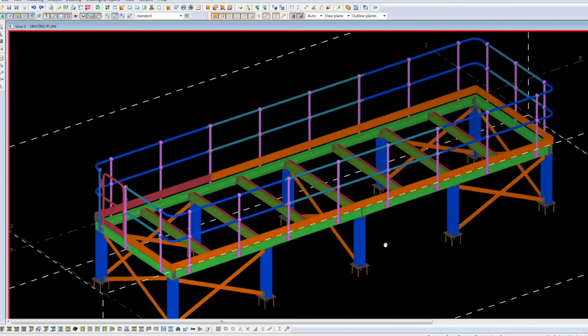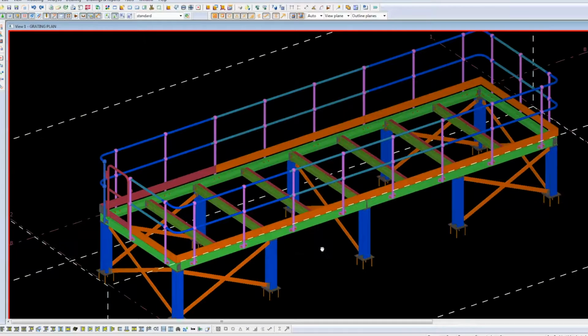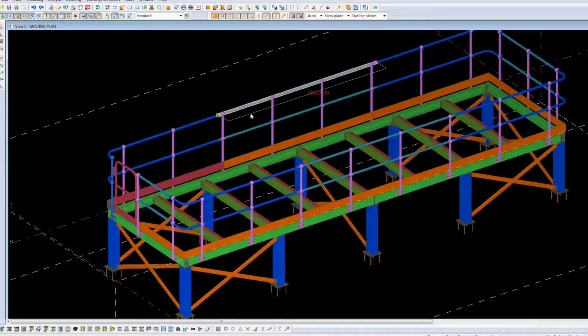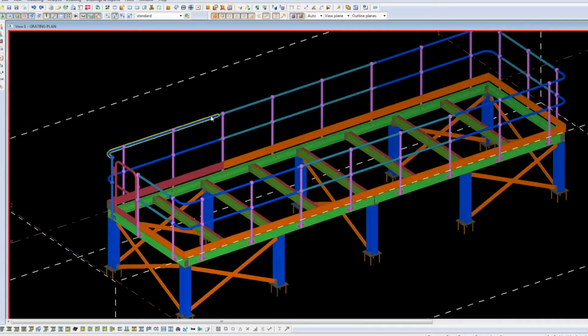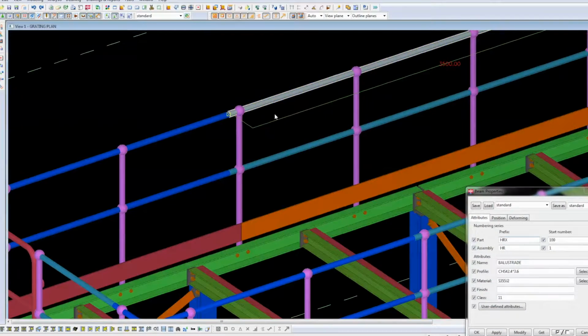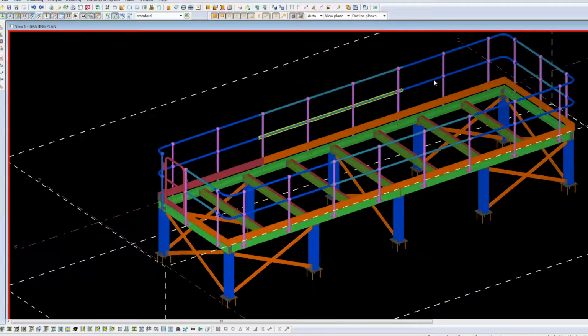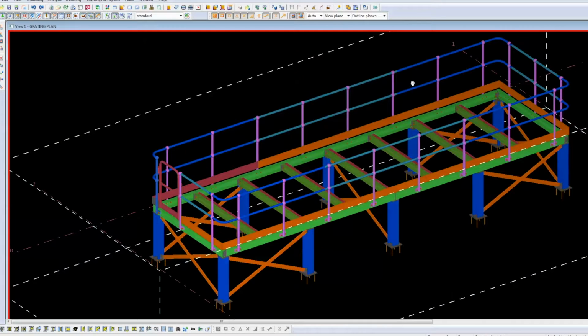Generally, for columns, beams, etc., I just use, like I say, any of those colours between classes 1 through to 14. Now that's something else that I do. It just shows me where I put my splits in. I've just used 2 different blues, class 4 and class 11, I think. That just shows me at a glance where they are, where they're jointed. Also, if I send this off as a BIM model for a client to look at, he can see clearly where I put joints in.